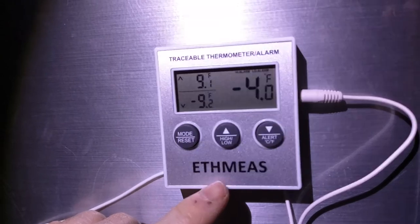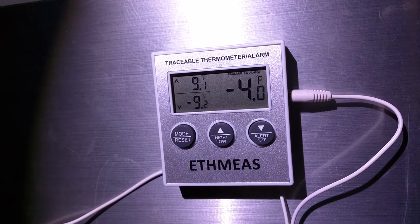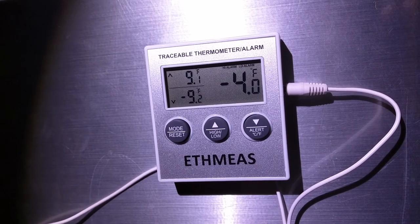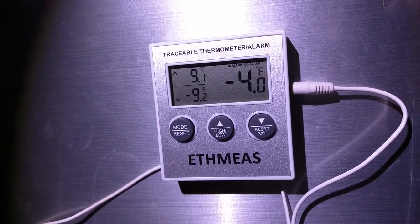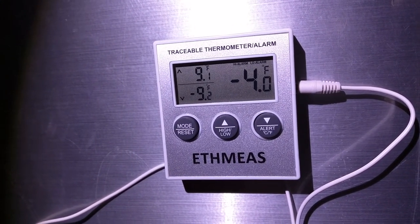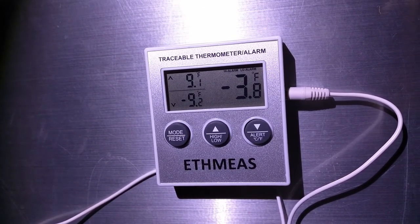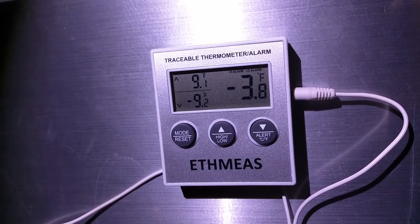This is a thermometer alarm. Because of the cold weather here, some people have tankless hot water heaters — the old style Bosch Aquastar typically — and in certain conditions, cold air will be pulled down through the vent over the heat exchanger of the Bosch Aquastars and cause the heat exchanger to freeze and then burst, which causes water all over the place.